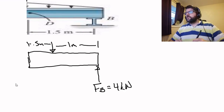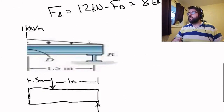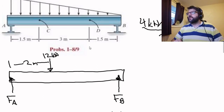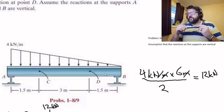And next things next. We're going to have a shear load. So basically, when we take a slice here, we need to find the internal forces. When you're pushing down like this, the rest of this beam is going to be pushing down on that face there. So there's going to be a downward force applied on that face. We'll call that V, because we use V for shear, because that's a shear load. As well, there is going to be a moment generated. We'll go into more detail about the relationship between moments and shear later.